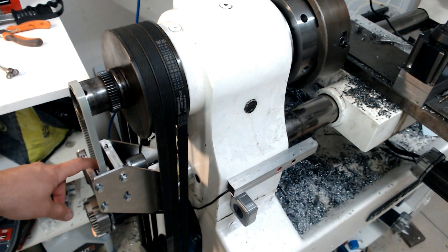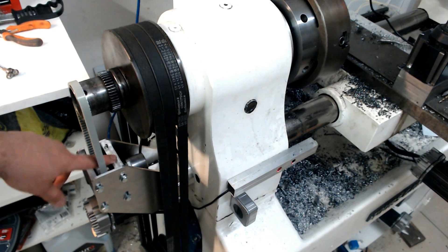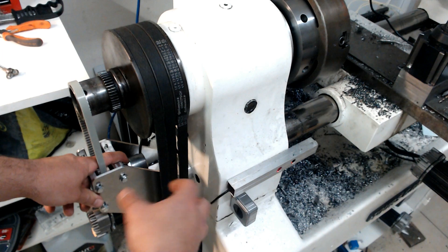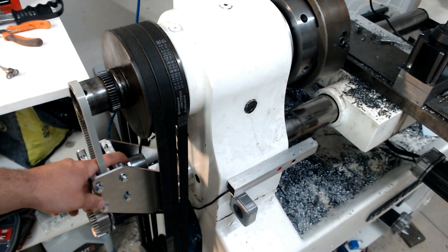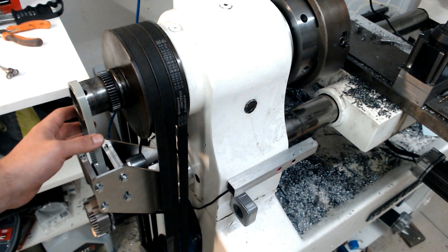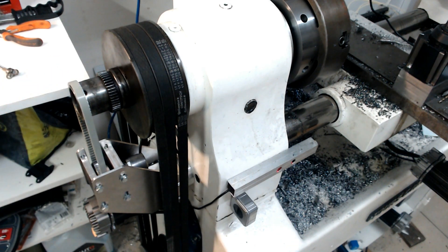The only thing is I only put a center bearing in there — I need to put another smaller bearing, which I didn't have, so I tried anyway and failed. It goes on the stub shaft that goes to the encoder; otherwise the encoder wobbles, and you don't want that. Once I fix that, it's going to allow me to do threading and tapping, which is obviously very useful.